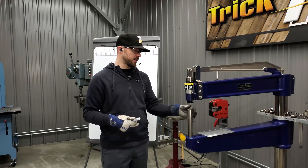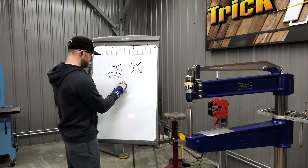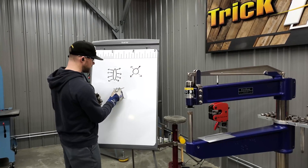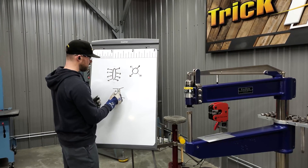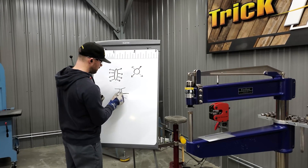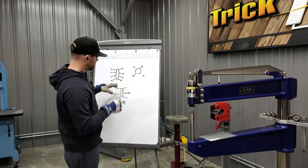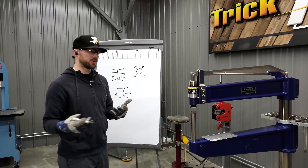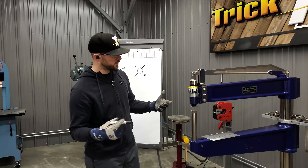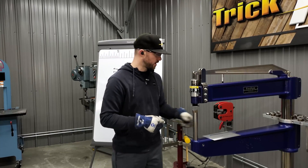What you would use this for: you can use it for stretching a flange. Think of stretching a flange on a shrinker/stretcher machine — on the stretching side, the dies are actually really close together, so when they come together they grab the metal and move it outward in a direction. That's a similar action to what's going on with a linear stretch die — as it hammers in that line it forces the metal apart, so you can get stretch.